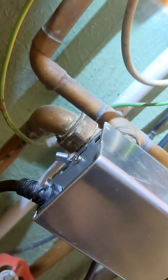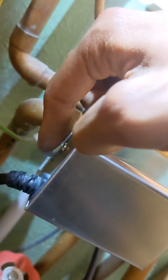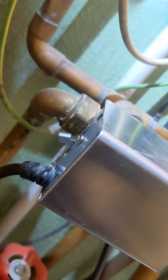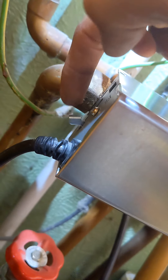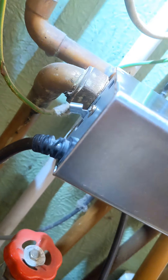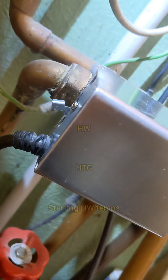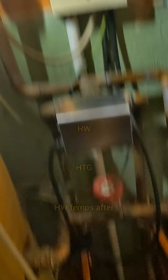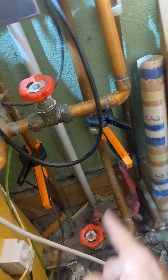The new synchron motor is in. If I take that off manual, it should spring back - lovely. Now we've got resistance and it springs back. Jenny, if you turn the thermostat up for me. There we go, that's motoring over. Click. The pump's come on. Now I'm going to measure the temperature with my temperature clamps - that's the heating side, hot water side.